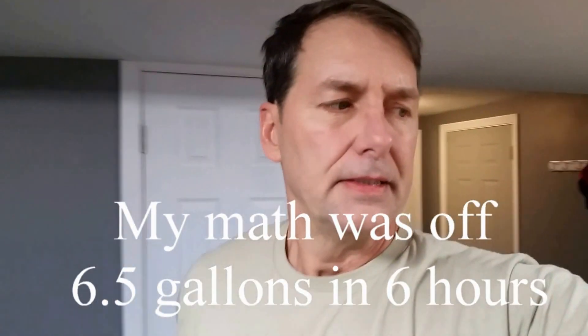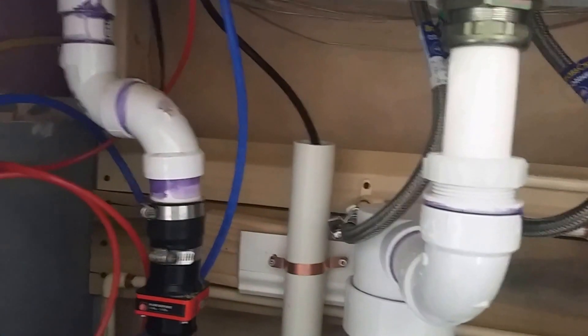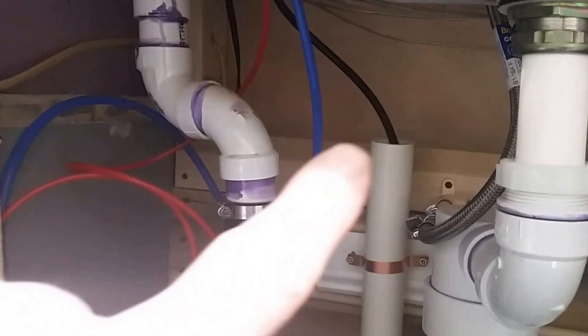Once the storage tank is empty, it produces an ounce a minute — that's it. To fill six gallons it would take about 14 hours. In my basement bar I have a pump-up system; this black tank pumps up because my sewer line is slightly above grade, so I had to do a few creative things including a pump-up system and a point-of-use water heater. A big consideration with RO water is the brine runoff, and the brine runoff is going into the vent tube here.